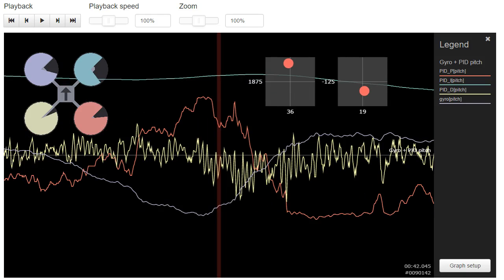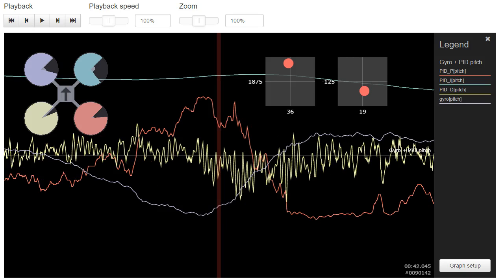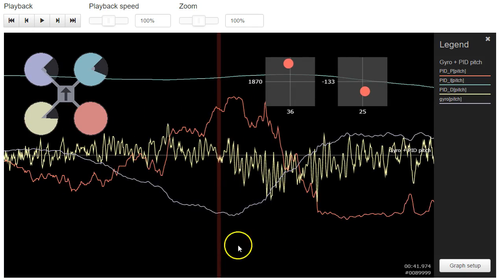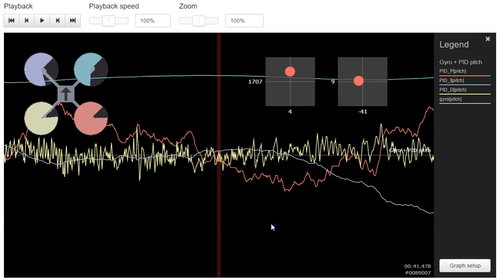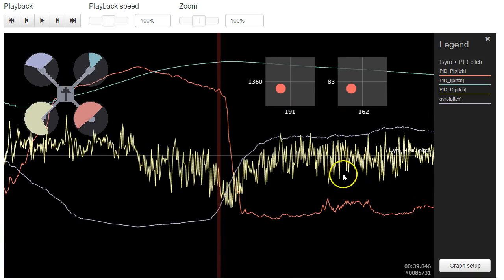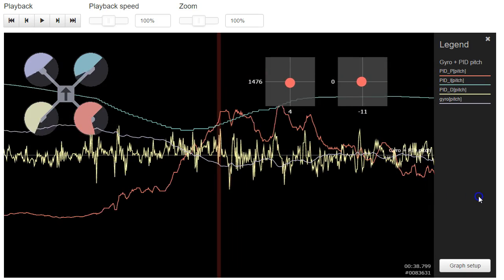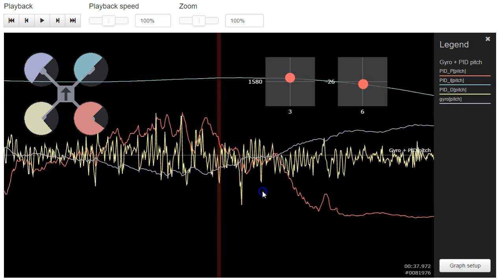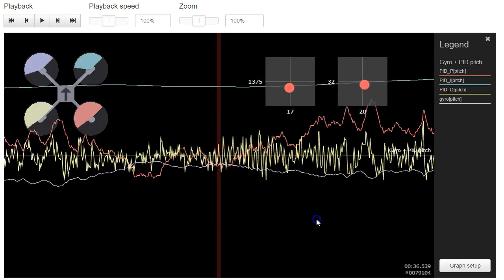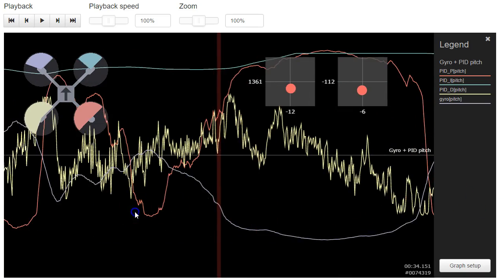There's a difference in the way the weight is distributed. There's oftentimes less noise on the pitch axis, and that may be why we're seeing less activity in the D trace here, because there's less vibration. The D term amplifies noise is one of the things it does. So this is sort of showing you that all else being equal, you probably will need less D on roll than on pitch. And that goes back to the weight distribution. The weight is more centralized on the roll axis and it's more spread out on the pitch axis for the type of frame that you've got. Because the weight is spread out, it's more inherently damped and less sort of nimble, if you will. And that results in less vibration.